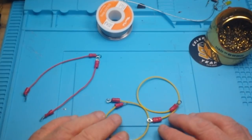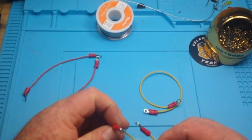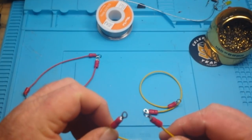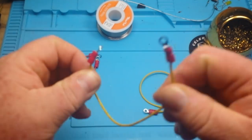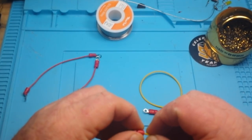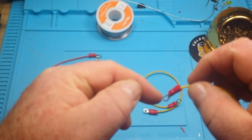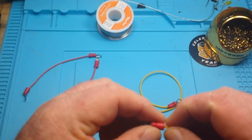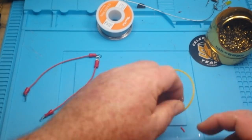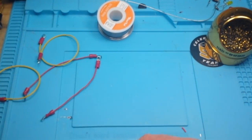Now when you come to stranded wire, this is where I think it makes a difference. If you're going to be using these in a high vibration environment — say automotive, motorcycle, marine, aviation — you want the flexibility of the stranded wire because it's going to be flexible. Except where you've soldered it. I was very careful to solder these down here so that no solder wicked up into the insulation jacket, so my wire remains flexible, just as it does with the crimp connection.